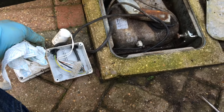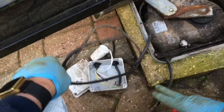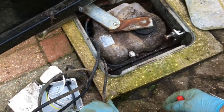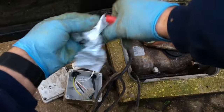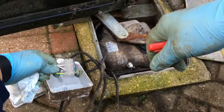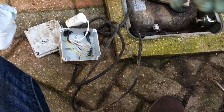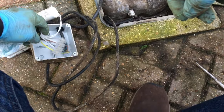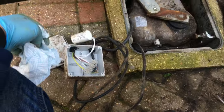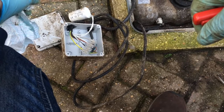While you're testing the motor, make sure that these cables are well out of the way — you don't want one of those pinched and cut into because it is a mains supply. Similarly, be careful about touching anything that's got live mains on it. Stand well clear with your hands whilst you're activating the unit, and if it goes off on its own, preferably disconnect the power to the main control box just to be careful.